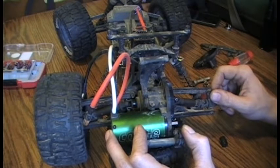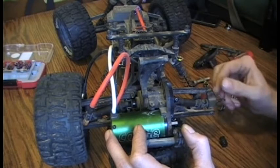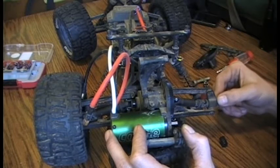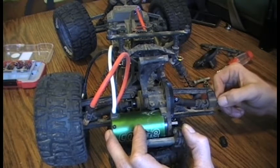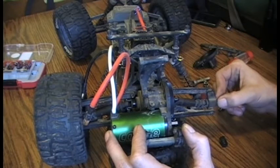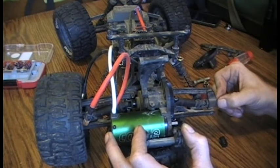As far as my driving style, I did set the punch on the speed controller to about 75%, just to limit the initial shock. This motor has a lot of torque and it's all available immediately. Without any punch control, it's a little hard to drive — all it wants to do is standing wheelies, even at speed up to about three-quarter throttle. No matter how fast you're already going, if you hammer it the rest of the way, it will still stand up and still flip.